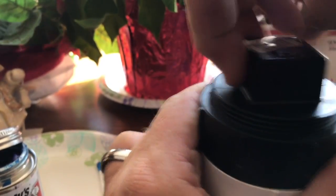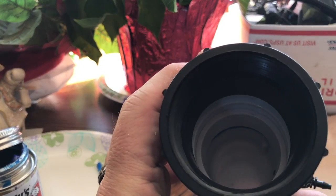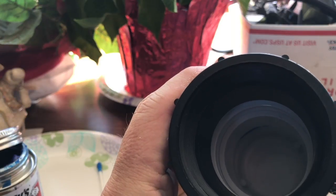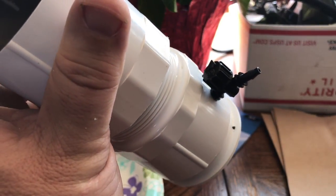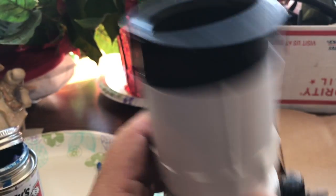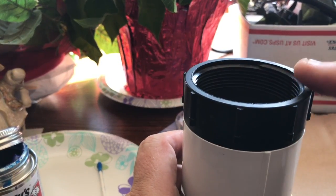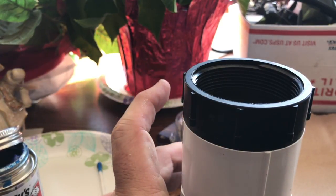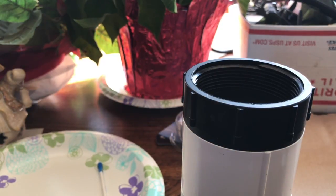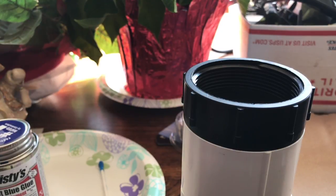What you do is open the top and fill your chamber to about the level of black, maybe a little higher, with your powder coat. Then you connect this to a fish pump — you can get them for like $6 or $7 at Walmart — with a little bit of fish hose, and you turn the pump on. Then you start dialing up your air. If the powder coating is bouncing out the top of your chamber, you have too much air pressure, so lower it down. Some guys get a really nice rolling boil. I take a small stick and stir it around, and it feels like there's absolutely no resistance — that's about what you want.